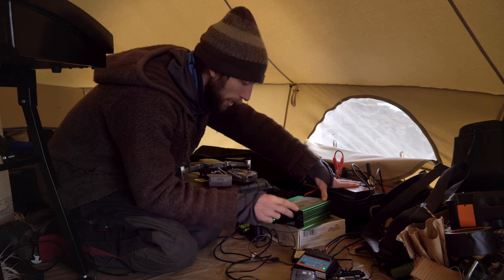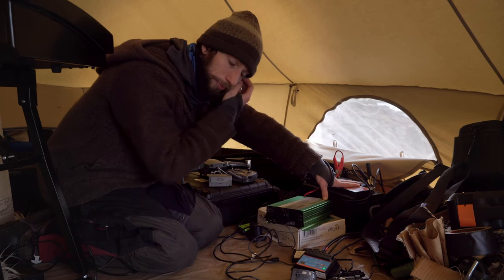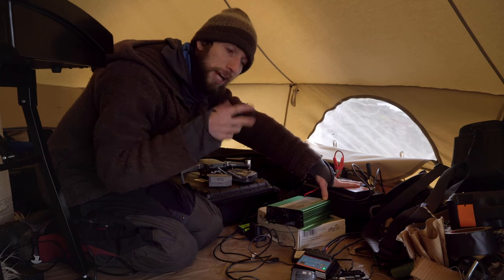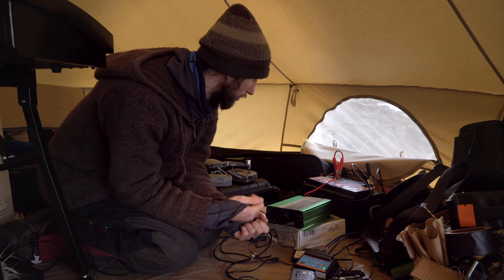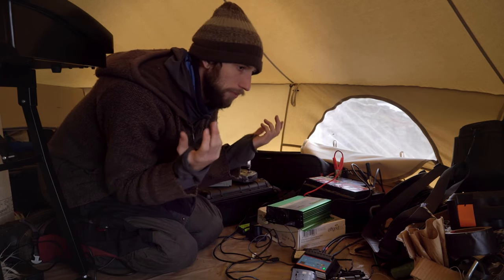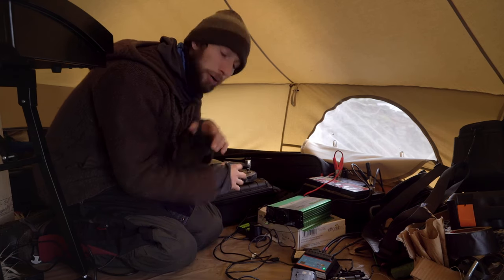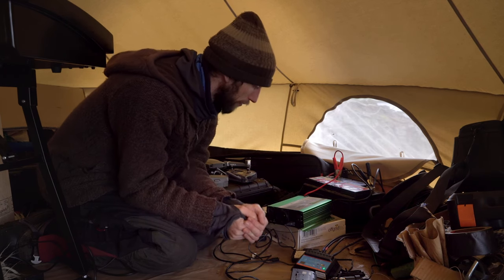With these power inverters, you need to be careful because you have devices that create a pure sine wave, like the electricity, because it's in a wave, or a cut-off sine wave. The cheaper ones produce a cut-off sine wave. You can use this if you have things like a light, basically anything that doesn't contain electronics. If you have a water boiler, something like this, you can use one of these cheaper ones with the cutoff sine wave. If you have anything electronic, like a piano for example, or a charger for the drone batteries, or a computer, you would need one with a pure sine wave, because otherwise it can damage your electronics, which is not good.